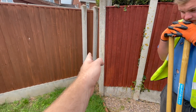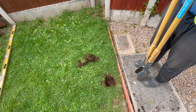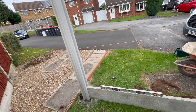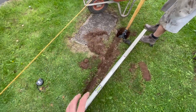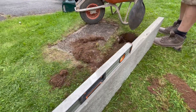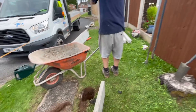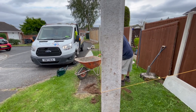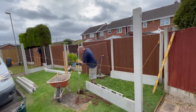There's nothing we can really do about that - we've got to go in at a little bit of an angle. So once we've got that dug and the post inside and set, we've dug a little bit of a channel for the gravel board just so that it sits level, because we're on uneven ground. We've levelled off the ground and we're just digging the next hole now ready for the next nine-foot post. We've set that string line up - lovely straight line. I'll put you on a time lapse and in the meantime we'll get this first bay in.